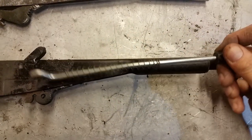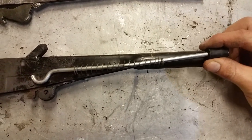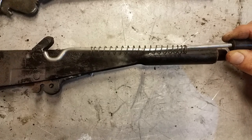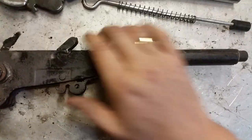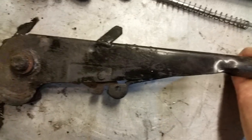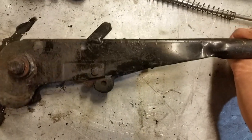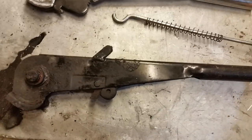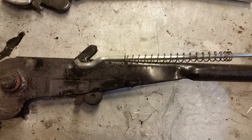It's hard to see it being black, but the bar is slightly bent and it hooks around the pawl there. The pawl on this one is a different shape. Rather than being that way around, you're pushing from the bottom. When you press the button it pushes the pawl into the cogs rather than pulling it away — and that's how it locks. Then the force of the handbrake pulling back down is actually what locks it into place. When you release it, it clicks back up and you can just drop the handbrake and you're off. It's just about changing the pawl design and flipping this round, and it works a treat.